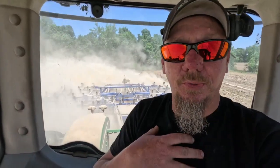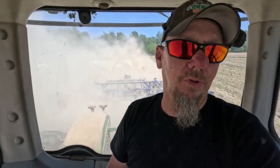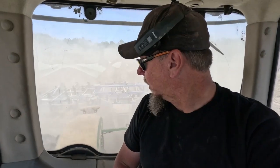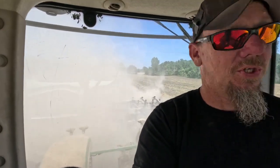But my situation, the way I do things, the way we're pulling them in and everything, I'm guessing, and this is just a guess, I'm going to get 1,200 acres out of those points. And that's the high side. I honestly, firmly believe at about 900 acres, I'm probably going to be looking at changing those. But 2 years ago, when I was running all John Deere points, I was getting about 300 acres out of them and changing them. So it's a big improvement. And for them to make a point that would last me 5,000 acres, that thing would be so big, so heavy, I don't think I got the horsepower to pull it. Just my opinion.